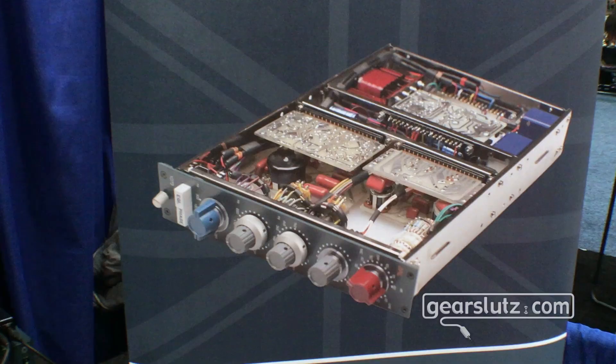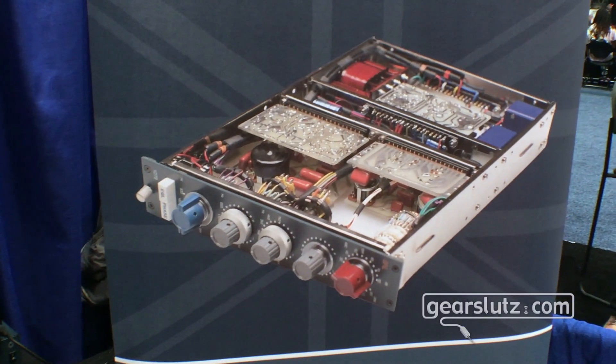The first one I want to talk about is the 1073. What we've done is created another 1073 with a few differences from our handmade, hand-wired version. It's still made in California by BAE, but we're calling it UK Sound. There are four main differences: we've used a different transformer — a Carnhill subsidiary called OEP; we've included the power supply inside the unit; we've modified the switches and used a Grayhill switch; and the fourth difference is we've put it on a single PCB. Same inductors, same components for the most part — getting that 1073 sound under UK Sound.